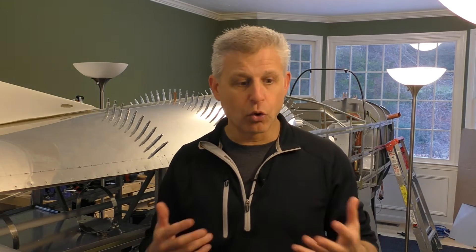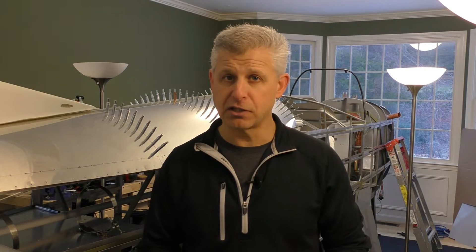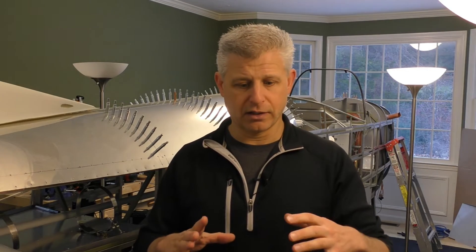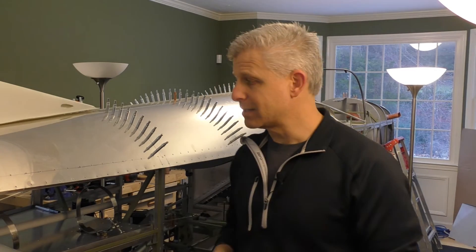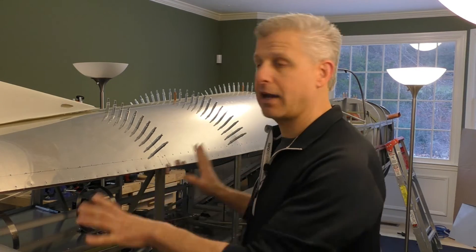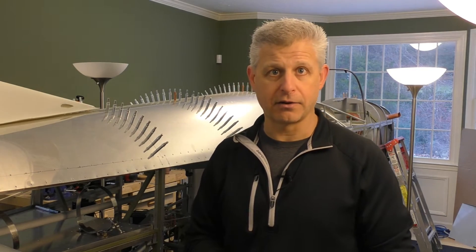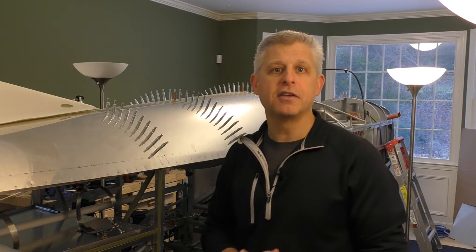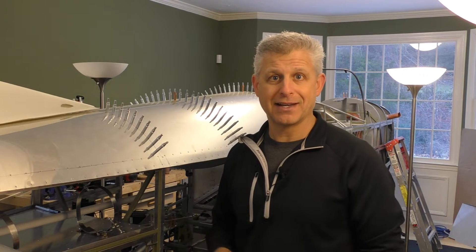What's interesting is that the same program can quickly cut out the doubler which will span that distance. Normally when you hand-cut a hole in aluminum, especially a large one for a door, it's a painstaking process. You work first on the opening, then take a completely different sheet of aluminum to manufacture a door to match, because you've destroyed the material you removed. This laser idea could be revolutionary for how we approach skins and openings on our T51 Mustang — so it's an experiment.